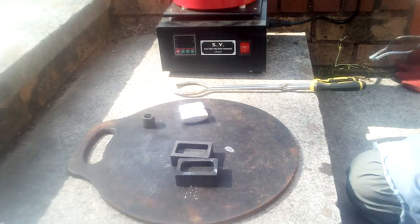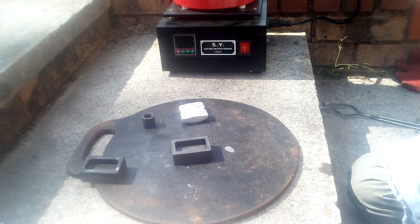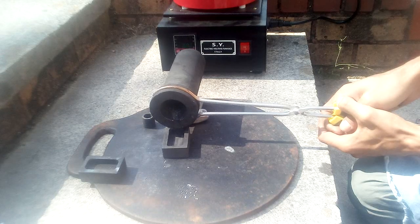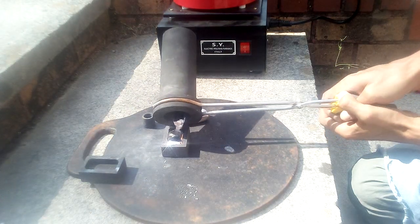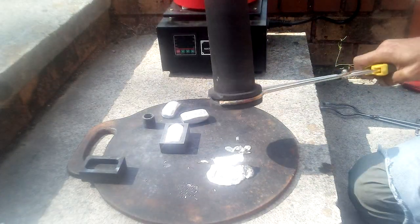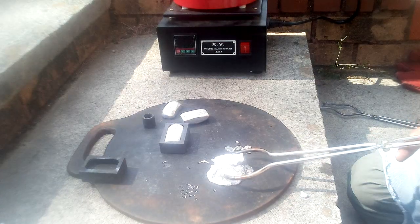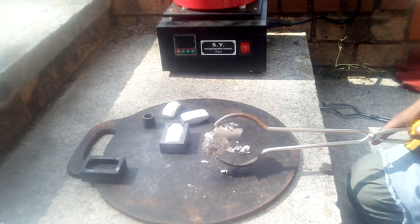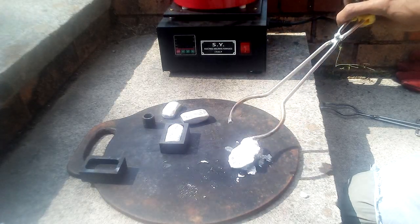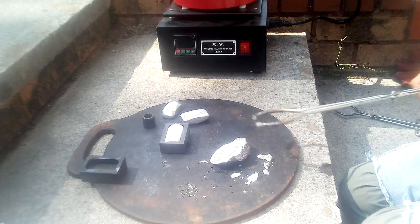Okay, those blobs have remelted — that's what I just used. I'll pour it into that new one here. And that's what's left — quite a bit of material there. That's dross or slag, whatever you want to call it. There's unmelted material full of impurities. It's actually extremely shiny on the bottom, so there's not that much foreign material. I could probably get quite a bit more out of that with some borax. I could use it in alloys of some such.